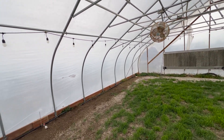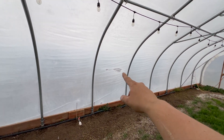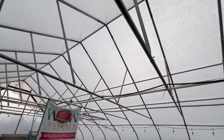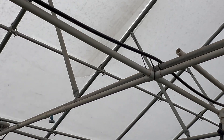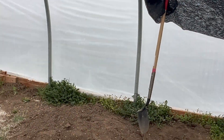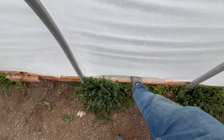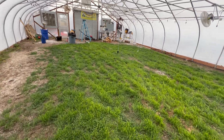So the last two things have to do with the structure itself. Maintenance-wise, we got some situations right here — you can see holes there and there. They weren't kidding when they said five-year plastic. If we look up, you can see holes, and the overall condition of the plastic — it's dimpled because of all the hail. There are some pretty big rips on the outer layer up there, and over here it's just wide open to the world. So that is obviously in need of replacement.